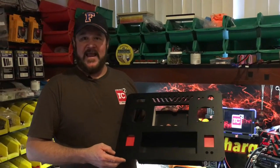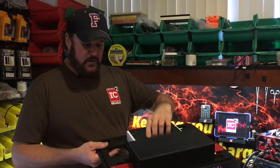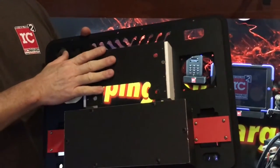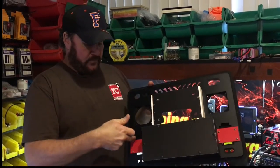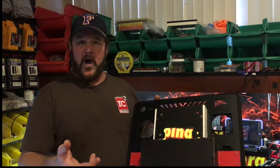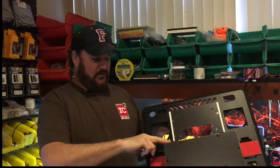With a lot of our kits being domestic and international — this is actually an international kit going to Bremen — we want to do a quick video so customers understand how to pull the two shipping screws out of the mounting plate. This actually has quarter-20 screws that come with the kit that mount to the bottom of the charger. This is a 308 Duo. Then you would plug the cables in to go to the balance, into the banana jacks, into the front of the charger. We supply 12 gauge wire and banana jacks — you're going to have to solder the banana jacks on at a 90-degree angle so you can get between the storage and the charge. If there's no storage and it's just a logo sitting there, you don't have to do the 90-degree angle and can use the cables that come with your charger.